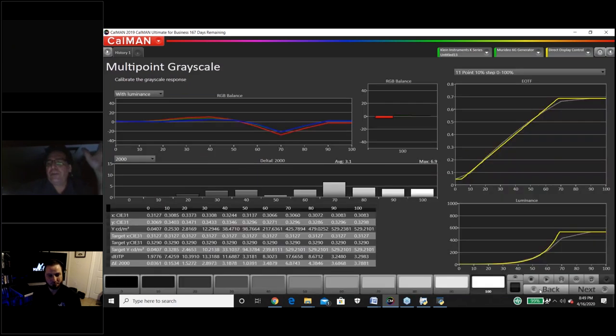You're not so much concerned about setting white point and black point on most of these products, because the black and white levels are inherent to the engineering, the mathematics of the product. So if you start to play with the black level or the white level, mathematically, the engineers are screaming on their computer chips because the levels aren't set correctly. I remember at the very beginning of all of this with HDR, everybody was still trying to figure it all out. And one of the first things I heard was you don't touch brightness and contrast. That is completely opposite of what we've always learned with panels, where you adjust brightness and contrast. So it was a bit of a learning curve, but we've basically got it figured out now, for the most part, at least.